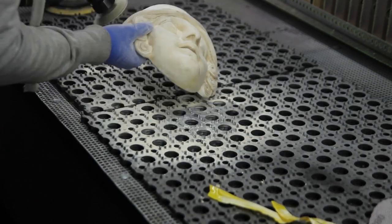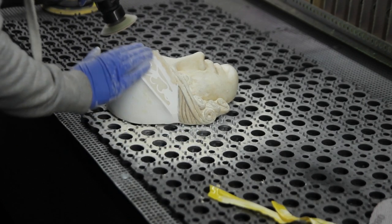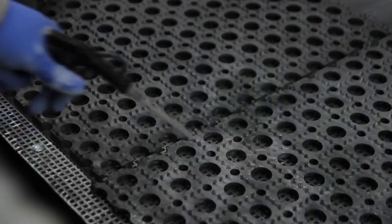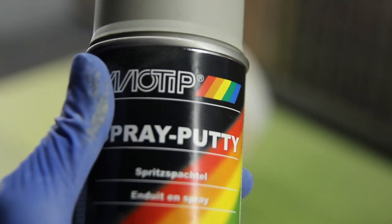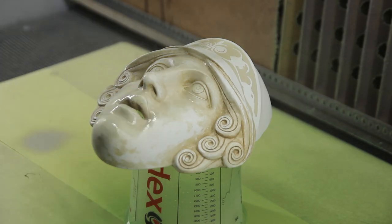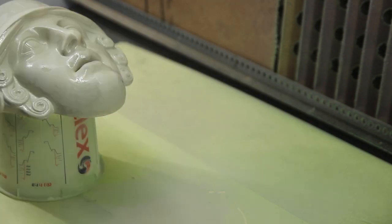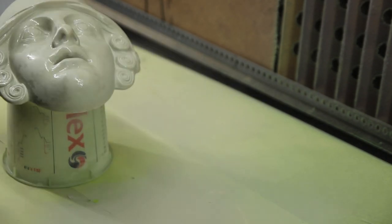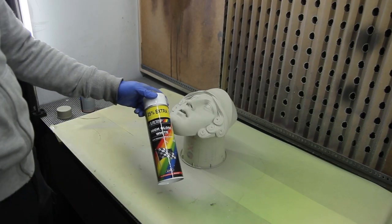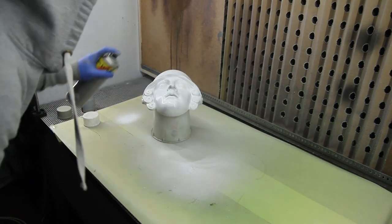Now the shape of the head is the way the customer wanted it. I've just removed any nips on the mask before adding some spray paint — I used a spray putty out of a can. The mask was quite smooth to start with, so you just apply a couple of layers waiting 15 minutes in between, and that way you'll have a scratch-free finish at the end.